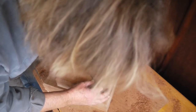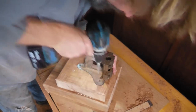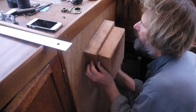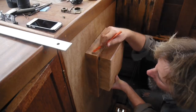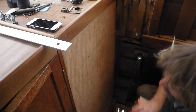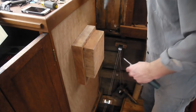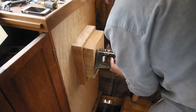Let's locate the helm - about there, roughly there. One and an eighth. Let's go line this up - just a matter of holding this in position. And that's pretty darn close, so I'm just going to scribe this against the bulkhead, and then I know where I can put the holes for the screws from the inside. Excellent - that's heavy. By the magic of having someone here at the marina to hold this in place, I've now screwed it from the backside and it is solid.